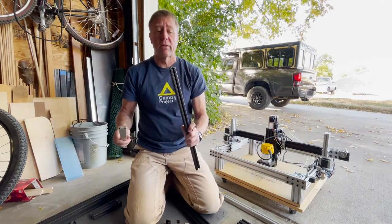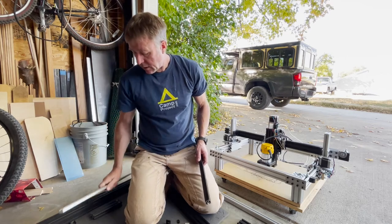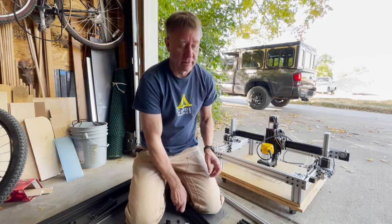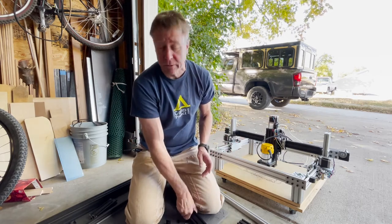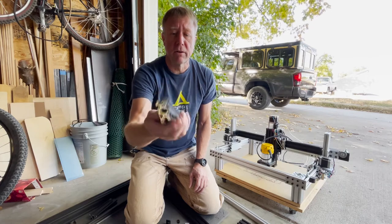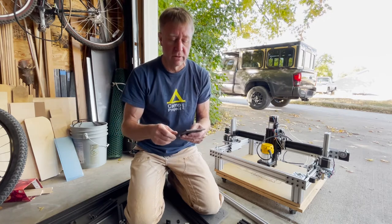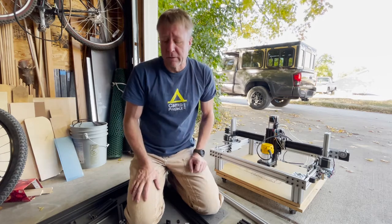I also got a quarter round and a half inch by one inch by half inch piece. It primarily comes in black and silver. When I first started with 8020 I'd always buy silver because it was cheaper, but now I always buy the black anodized. I always get the holes tapped because I'm tired of tapping holes myself — they have the machining capability. For these tubes you pretty much have to have them machine the holes unless you have a CNC or mill. For plates I've been making my own, and I think the holes I use are a little smaller to give a tighter tolerance and take out some of that slop.